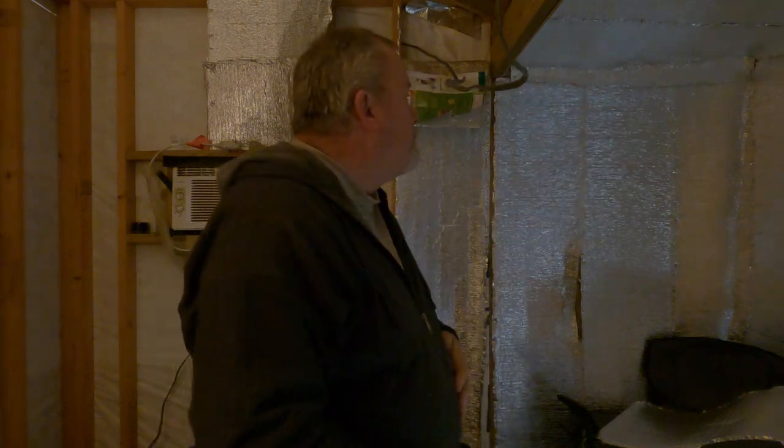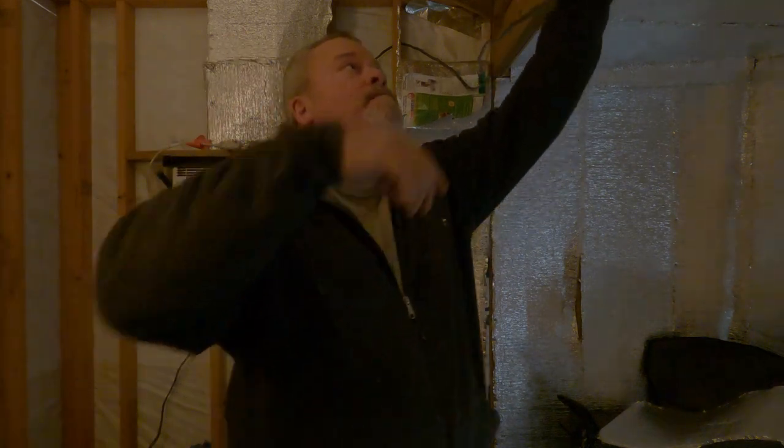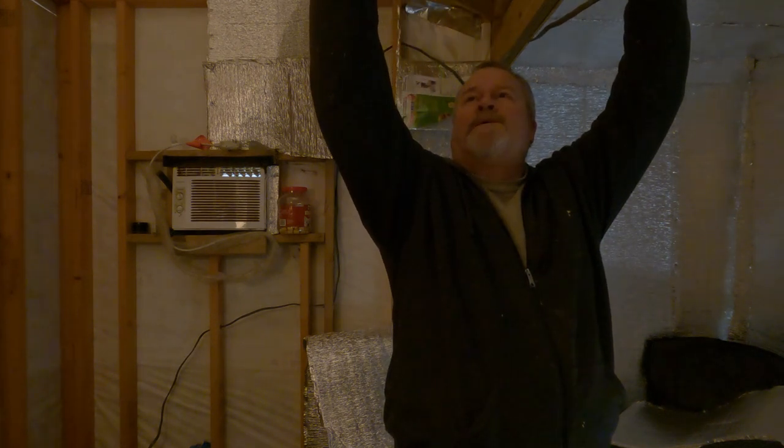But I'm going to get this electrical tapped up where it needs to be and probably get that light fixture on there. I'm going to wait and get a metal one. I don't like these plastic ones. Then I'll have the light switch. All I'll have to do is take that 14-2 and run it up probably through there and come down. It'll be a little longer than it needs to be, but then I'll have my switch there. That way, when I come in and open the door, the switch is right there. I could even put it on the other side of the door. I may do that, and that way I can flip the light on before I even come in.